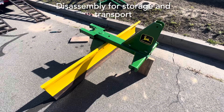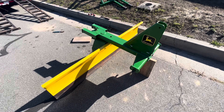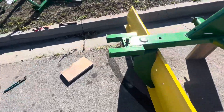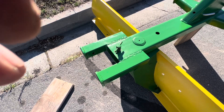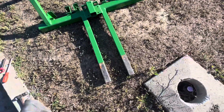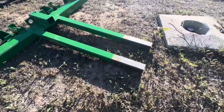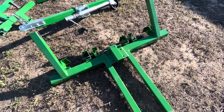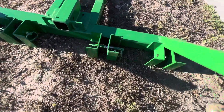A little primer on our John Deere Katana. This is a standard John Deere blade that revolves 360 degrees. It's used for grading with a hitch on the back of a tractor. What we did was we welded two heavy trailer hitch mounts on the back, then extended two pieces of square metal out of the back that fit it, and we drilled holes in those so they could be pinned to it. Then we put on a heavy cross beam, teed it perfectly.